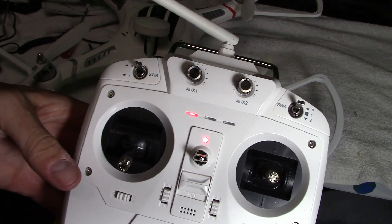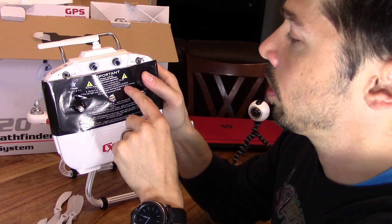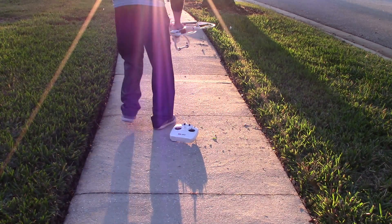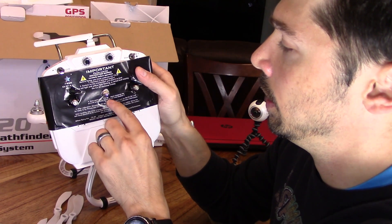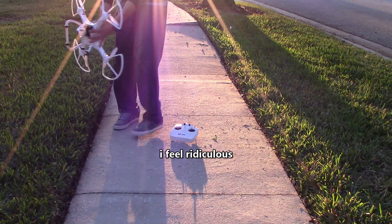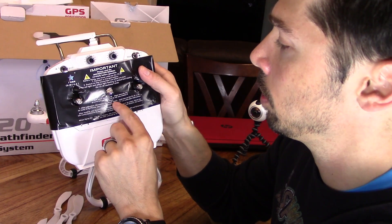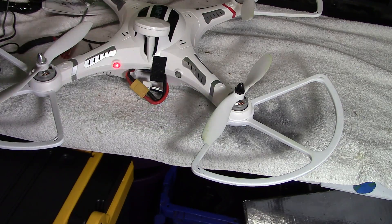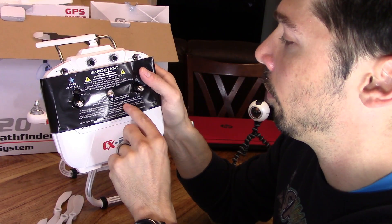Don't forget to turn it to the bottom left to disengage the motors. Step three: the red light and yellow light flashing — rotate the CX20 clockwise four times to vertical level. Step four: now point the CX20 down towards the ground and rotate about its roll axis another four times. Step five: after calibration, disconnect the power supply. Turn on the CX20 and it will be ready to fly. When you're done, just disconnect it and reconnect it when you're ready to fly. Please read the instruction manual for full calibration information.